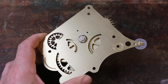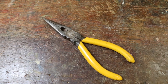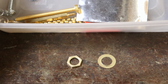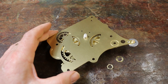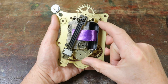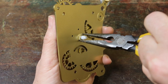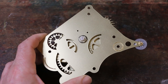Now to attach the clock movement to the rear gear cutout. A pair of pliers will be required. Pull off the masking tape or similar from the clock movement spindle, and remove the brass nut and washer. Place the rear gear cutout over the clock movement as shown, replace the brass washer and nut, and rotate the clock movement so it lines up vertically with the rear gear cutout. Then tighten the brass nut firmly with your pliers — don't over tighten it, it just needs to stop the clock movement from rotating. Your rear gear cutout should now look like this.